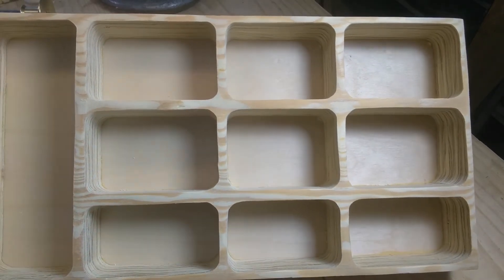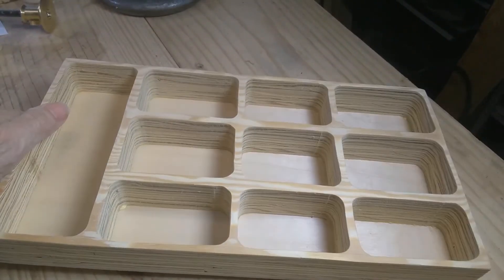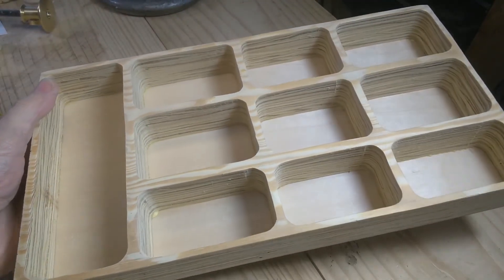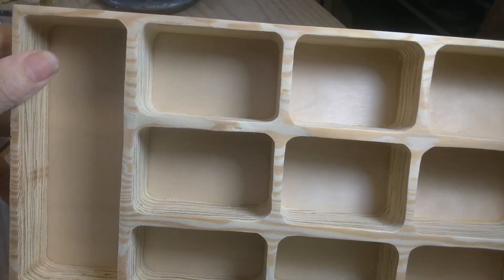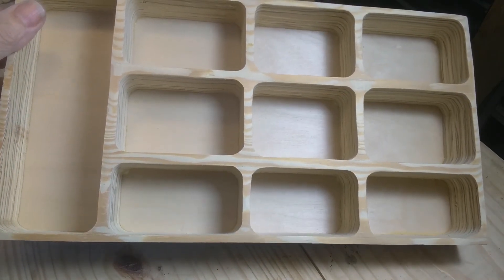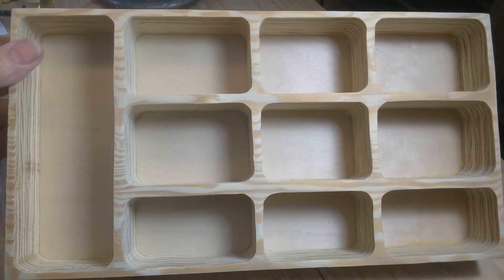So there we have it — that's my redneck woodworking drawer organizer. Just plywood — three-quarter inch with an eighth inch Baltic birch on the bottom. I didn't do a lot of extra work on it, just some sanding and relieving of edges, and glued the bottom on. We already checked the fit in the drawer. I'm going to let her use it a while and we may see about a finish on it later if she wants one. I'm pleased with it and she likes it too. If you like that, hit the like button, and if you're not subscribed, hit the subscribe button.